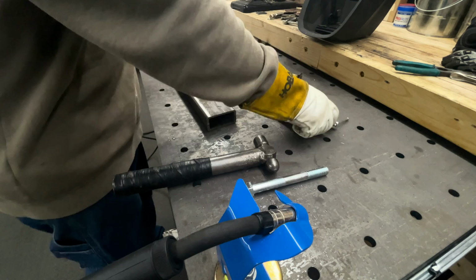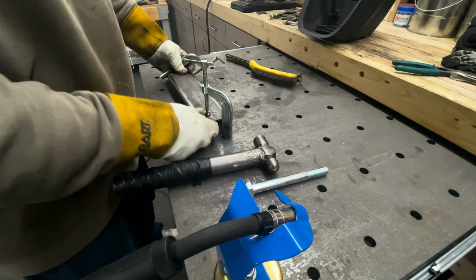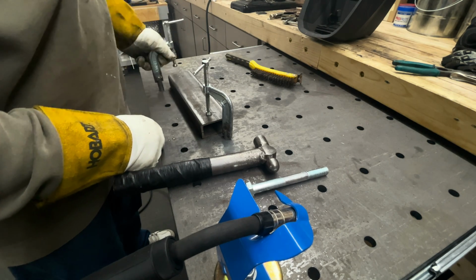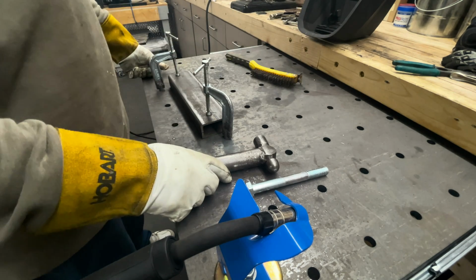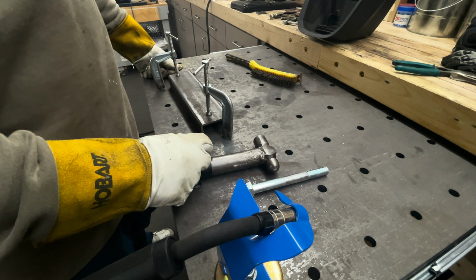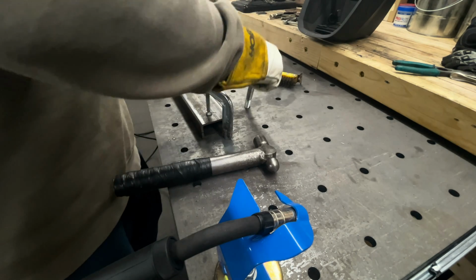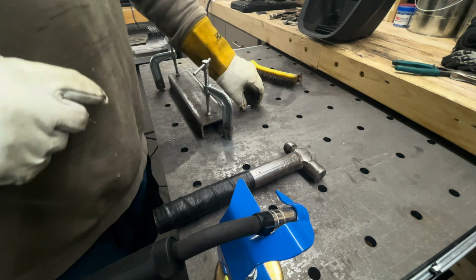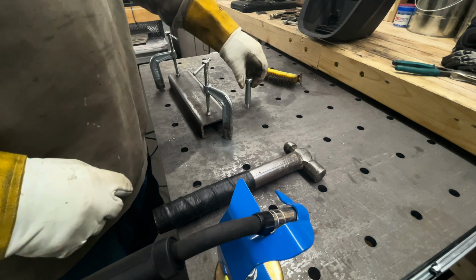All right, so there we go. We've got 2 clamps. They go right into these 5/8 inch holes, and you just clamp them. You can clamp anything down in here I want. And I can move these clamps into any one of these holes that I want, and it's going to hold whatever I'm welding secure. So I can make a whole bunch of different tools. I can even just use a 5/8 inch bolt as a stop for the layout table.